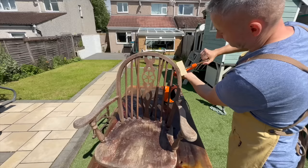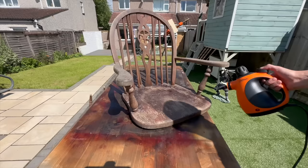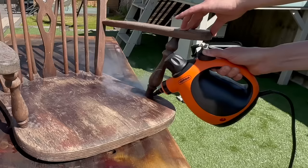A couple of reasons why I did it this way. One is because it would make the gluing process a bit easier, but also I didn't want to worry that all the tension in that wood would make it delaminate and go back to its original shape.